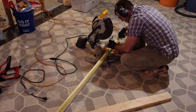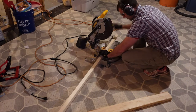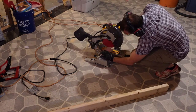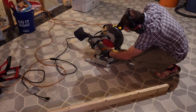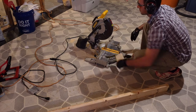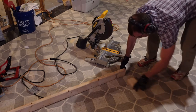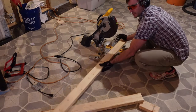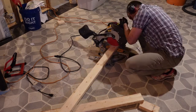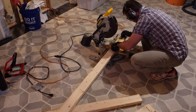It only has to hold up drywall, so there won't be a large amount of weight on the wood. I'm cutting these eight-foot sections down slightly so the ladders join on a floor joist rather than hanging between joists — that gives better stability and ensures the drywall doesn't crack over weak joints. For all the rungs I'm also using two-by-fours, cut to exactly seven inches, which allows the two-by-two to sit just below the ductwork.